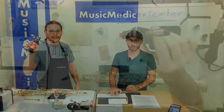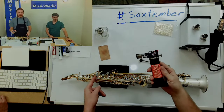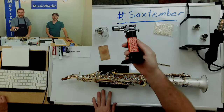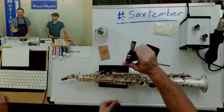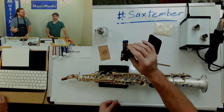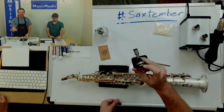The traditional tool in the band instrument repair trade is just a butane torch. I used these for a number of years for basically everything — you can do your padding, you can do a lot of soldering. You just refill the butane and there's your flame. It's a very blue flame, a fairly hot flame — you can do soldering with this.